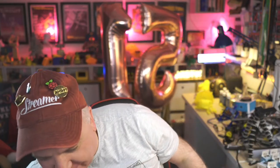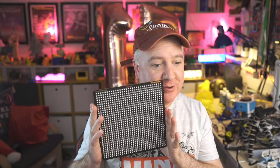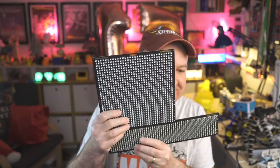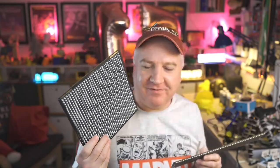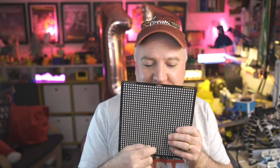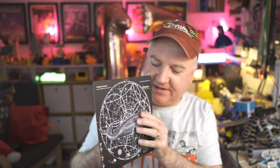And then the other thing Pimoroni launched, I happen to have a copy of, was the Cosmic Unicorn. This is similar to the Galactic Unicorn. You might have seen one of these Galactic Unicorns previously. Just look at all these pixels here. Good grief. You can see just how massive this thing is. This has got 441 extra pixels than this one has. It's got 1,024 pixels in a 32 by 32 grid. And this one also has 4 user buttons on that side and 5 user control buttons on that side. And it's even got a little speaker on board as well.